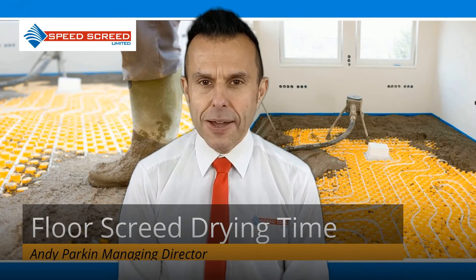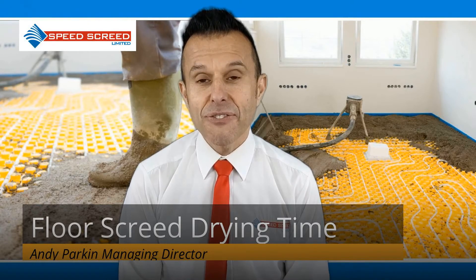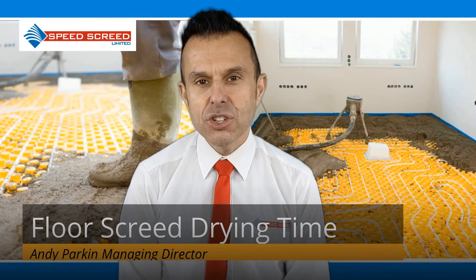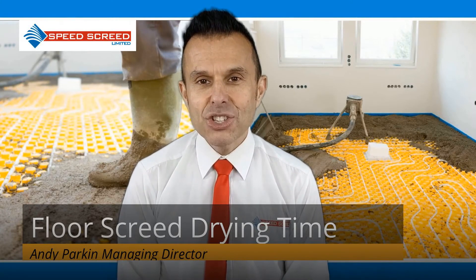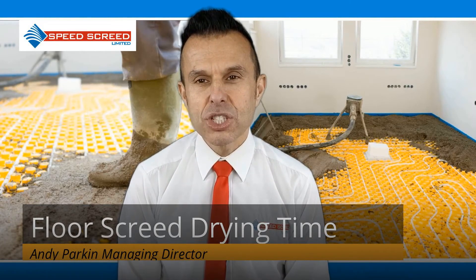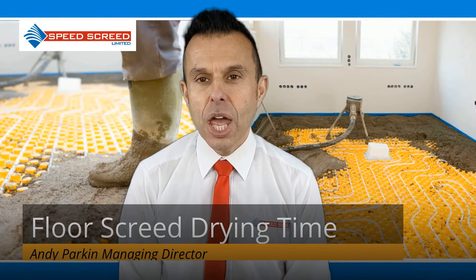What can impact floor screed drying time? The two main factors that affect the amount of time the screed takes to dry out enough to take a final floor covering are temperature and humidity. When a manufacturer lists a drying time on a product, it is usually based on a temperature of 20 degrees and relative humidity of 60%. Any variation to this impacts the drying time. Industry standard is to accept a floor covering — a screed should measure 75% relative humidity, but this is also subject to manufacturer's instructions. The only way to be sure is to test the screed, and this can be done in a variety of ways. Always check with the manufacturer which one they recommend.